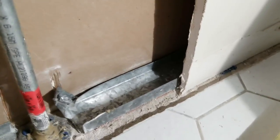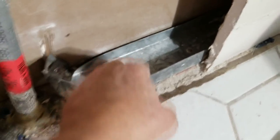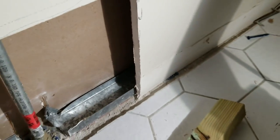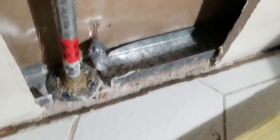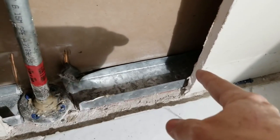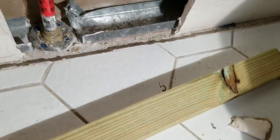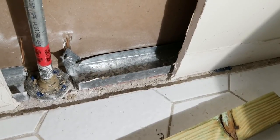Here's another cause of the wobbling walls: the bottom plate here is really thin gauge metal and it's flexing. Since drywall flexes too, the whole wall's going to move. To help reduce movement we're taking this wood block, running it down the channel - already sliced to fit - and screwing it through the drywall through the metal stud and into the wood stud. The wood piece is a lot sturdier than that metal, so we're essentially doing cabinet blocking that will minimize any movement in the walls.